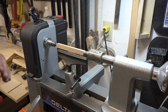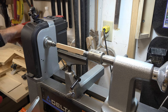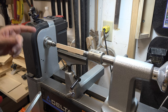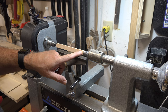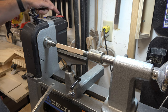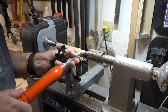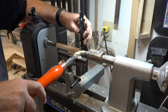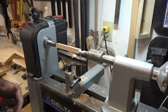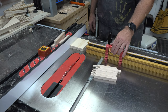With the holes marked, we need to make the fence posts. I have a five-eighths by five-eighths piece of maple chucked up in the lathe, six inches long — that's overkill, but I'm going to turn one end down about an inch to a three-eighths inch diameter round tenon. With one done, I'll turn five more.